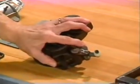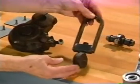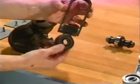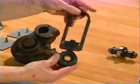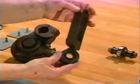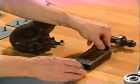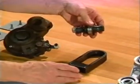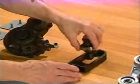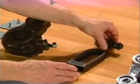From this table drive assembly, we have this over-travel clevis, which in itself is carrying the table. The actual length of this clevis will determine the heights of the table above the deck. We can make this longer to lower the table or shorter to raise the table. We would, of course, inspect bearings. In the over-travel clevis itself is another ball bearing. This one rolls up and back in this clevis when the table rests on an outer range pin.